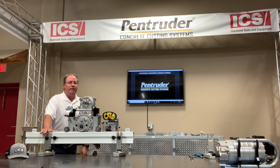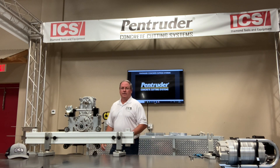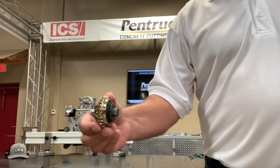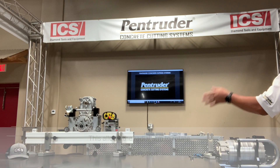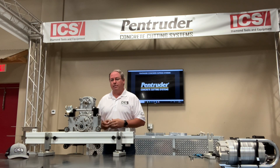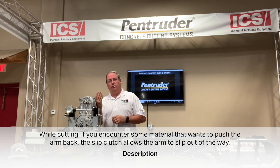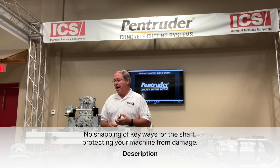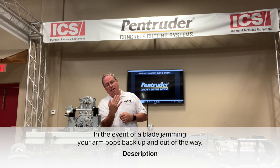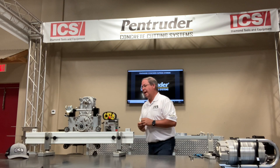Cutting concrete is a dirty job — blades jam, anchors pull out of the wall. To protect the saw in those situations, there is an actual slip clutch driven by the arm feed motor. If something grabs the blade and wants to push the arm back, the slip clutch allows the arm to slip out of the way. You're not going to snap any keyways or snap the shaft. If you're down in the cut and the blade jams, the arm can actually pop back up — saving you a lot of time and headache with broken gears.